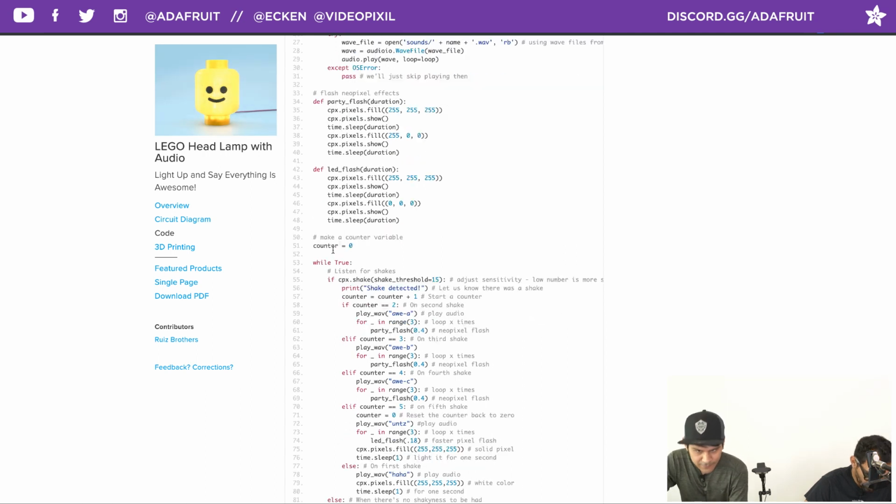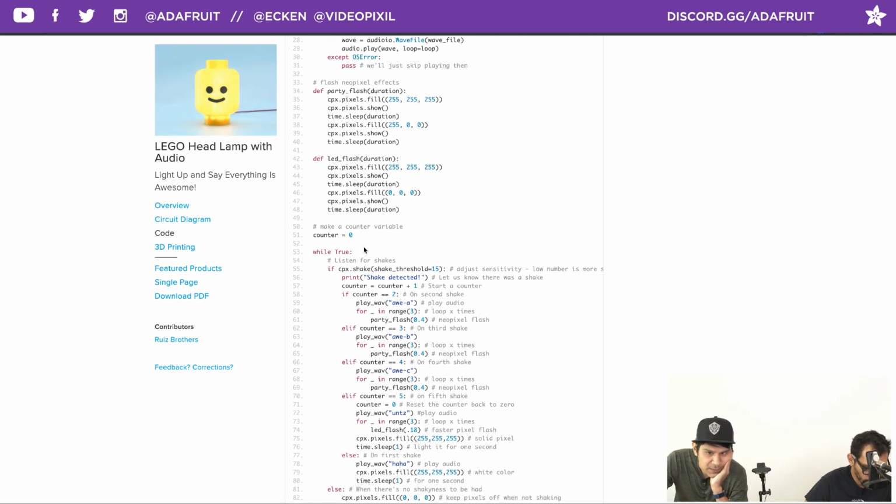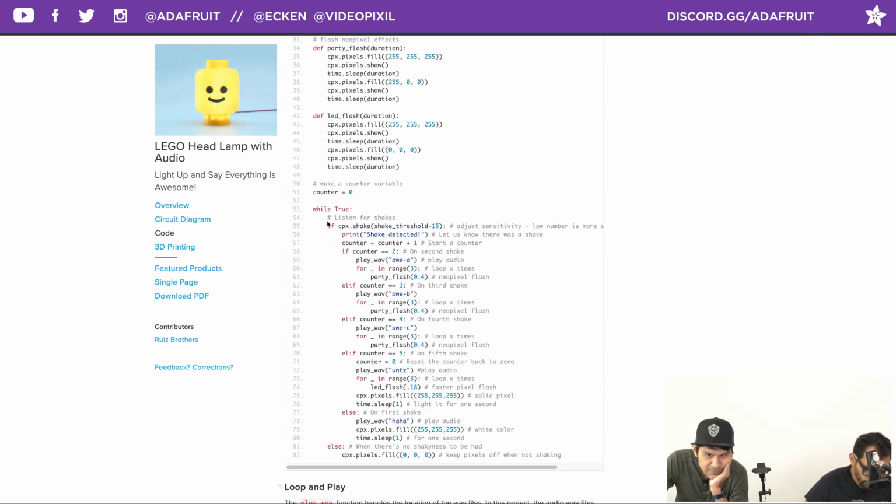All right, and then my first variable or whatever is called counter, and I set it to 0 because we need to keep track of how many times we shook it. So in my while loop, I am listening for shakes. So I'm saying if the shake threshold reaches 15, let's do some stuff. So that's what this is doing here. You can adjust the sensitivity. It says here in the comment, low number is more sensitive. So I have 15 here is what worked for me.